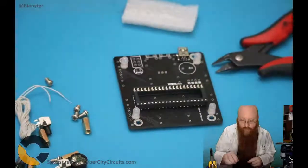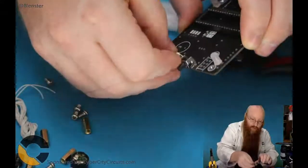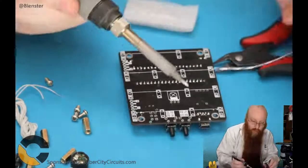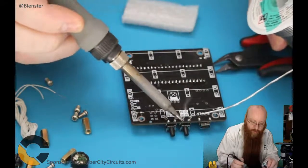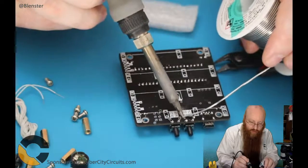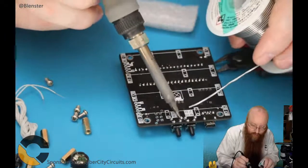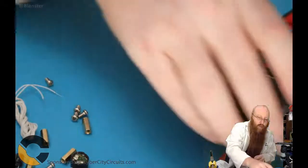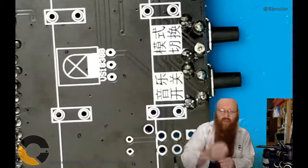We have two tactile buttons. They're going to go in on this side here, like this. So let's give you a wider view of the soldering on this side. And again, I want to tin the iron just a little bit, not too much. There's definitely a Goldilocks amount. One of the mistakes I see people making all the time in my classes is using too much tinning. This is one of those gotchas that will even cause people who've been soldering for years to go, oh wait, I've been doing this wrong. Look at that. There we go. You can see those are beautiful.